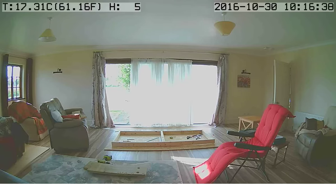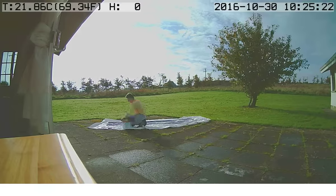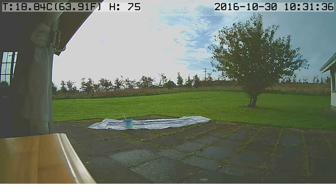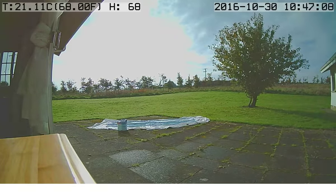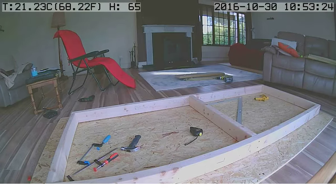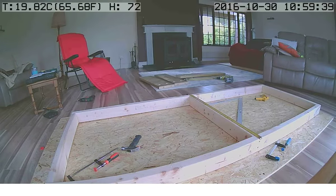Now going outside where I'm painting the angle irons — laid them out on a tarp and painted them with water-based paint. As you'll find out later, that might have been a bad idea because I left them overnight and the dew got on there and made them rusty.